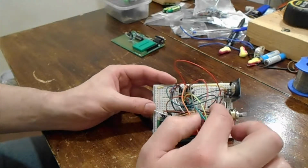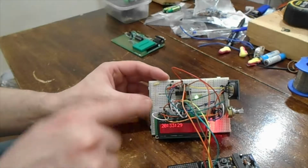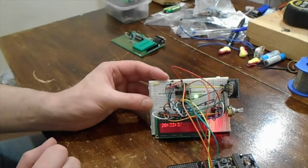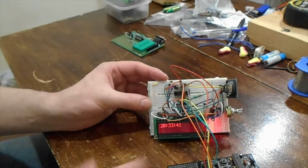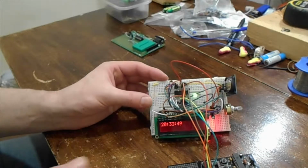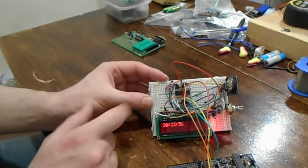The LED, I like putting little LEDs. It's just like the very start of the program. It just basically exclusive ORs the value of whatever port register that's connected to against 1. So if the port in that file location was a 1, it becomes a 0. If it's 0, it becomes a 1. And it tells me, even if, say for instance, and it happened with this, my display wasn't displaying anything, but the LED is still flashing, it tells me it's not stuck in a program loop or got lost from too many calls in the stack, because it's only got a 2-level stack, this chip.